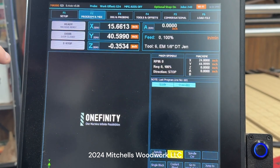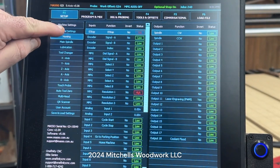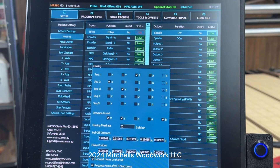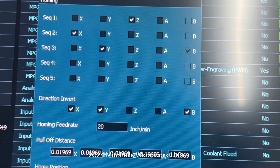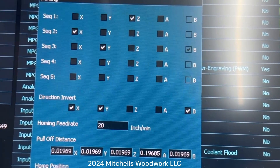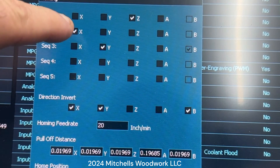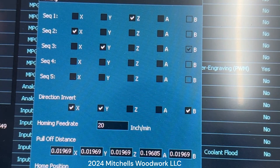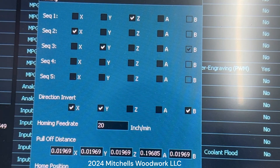That is crazy slow. Here's how we fix it: go to F1 > Setup > Homing. This is the default setting — it will home your Z first, raising it up. Then your X will move over to the far left, then the Y will start moving forward until it gets to the home position. All of this can be improved upon.